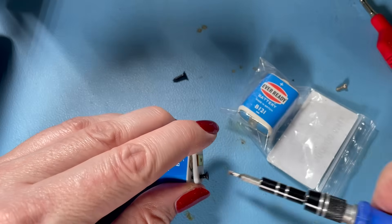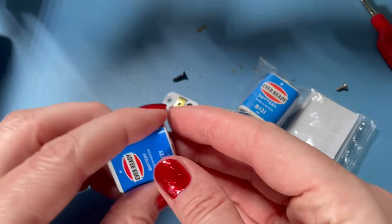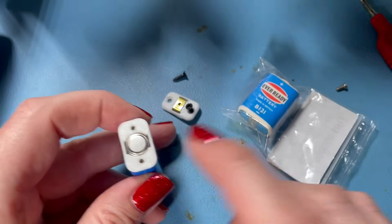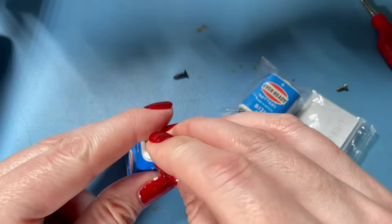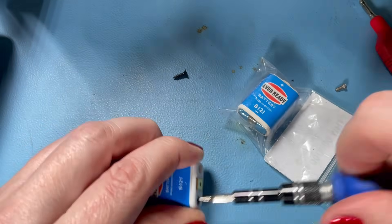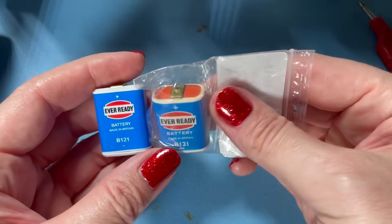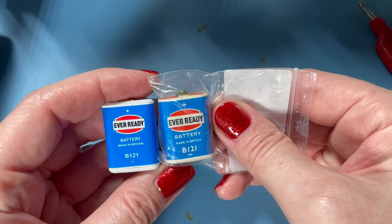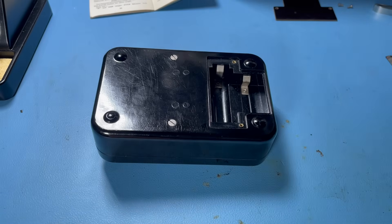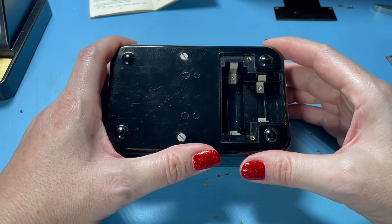You can see what they've done — they've just put button cells inside, just enough to get the right voltage. It's just the right size to fit in our little Taylor meter. You could say it's tailor-made! This is very cool and almost indistinguishable from the real thing. As for the U10, you can order them but they're a bit specialist and quite expensive. I've seen a trick on the vintage radio forum about soldering nuts to the end of double-A batteries.